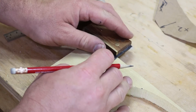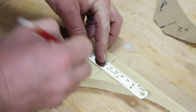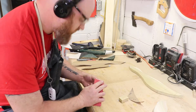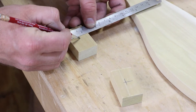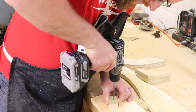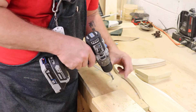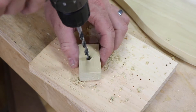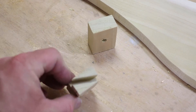For two pieces that are not actually a template, you're going to want to cut them out of the 3/4 inch thick wood. Cut two blocks that are two inches by one and a quarter inch, then make sure everything has a nice good sand. With these little blocks, you want to find the center and drill down through the hole. This hole does matter depending on what size screw you're going to use — I'd make sure that you have the screws already in hand. You don't want it to be super loose; you want it to be just snug enough to where they will hold but still have some play in them.